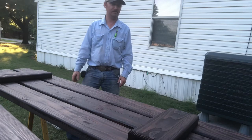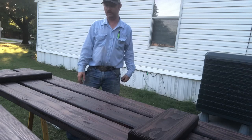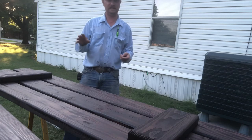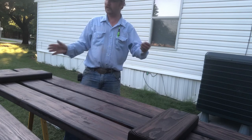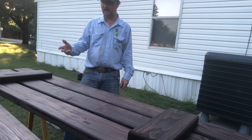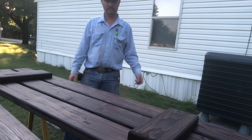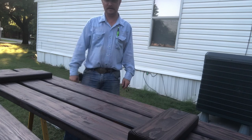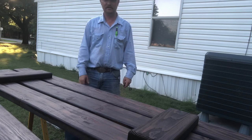These are still a little damp - we had over three inches of rain yesterday and the humidity is so high they won't dry in time for tomorrow morning, so I'll see if the customer is okay with waiting until Monday. These were built completely with six two-by-six-by-eights - that's all you need for the boards and the battens to make a nice set of six-foot shutters. All you need is a miter saw, router, drill, tape measure, countersink bit, a round-over bit, and a V-groove bit. Let me know if you make a set - I think they look pretty classy. We'll catch you on the next one.